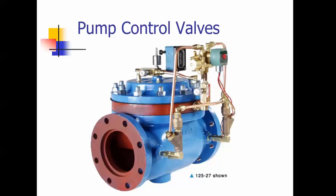This is a pump control valve. When you turn the pump on, this is closed. It's a regulator type — a pump control valve — and it keeps pressure on top of the bonnet. When you kick the pump on, the pressure on top is released and this slowly opens. The diaphragm in here slowly opens up and trips a mechanical switch. When you shut the pump off, it continues to run while water is pressured back on top of the bonnet and this slowly closes. As it comes down into position, it trips that switch and that is what actually shuts the motor to the pump off. This essentially starts and stops against a closed valve, which minimizes water hammer on your system.